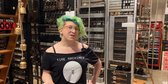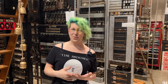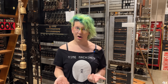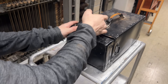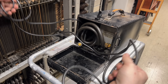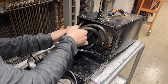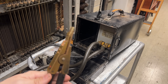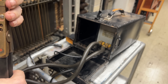This is actually a convenient excuse to break out the contact welder and have a little fun. Now, this is not a thing you want to mess around with unless you kind of know what you're doing, because there's a pretty good chance you could mess up a relay even more by using it wrong. The official documentation even warns you to practice on a spare relay first before trying this for real. But I've done this before, so I think we'll be able to fix this with no problem. The contact welder plugs into AC power and has a special button that operates the welder for exactly the correct amount of time to complete a weld without actually damaging the relay spring. The business end of the welder is these pliers here.